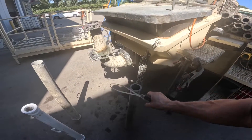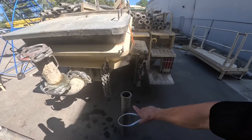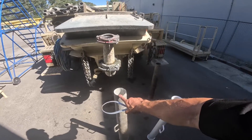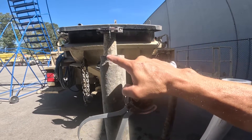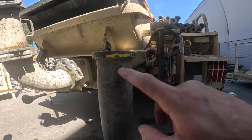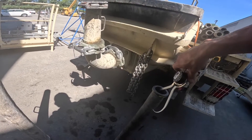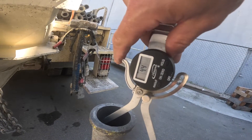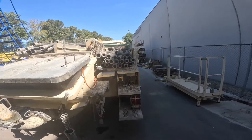I wouldn't wear this down much thinner than it is. Two and a half to three mils is kind of what I would say. Brand new, they're almost seven. So when we get down to about three — where this is — it's time. Don't measure down at the bottom; measure right where that flange is, from the weld to the flange right in here. Not down here, because it's still nice and thick everywhere else. If I drop in a little bit further, you're still at about 4.4 millimeters, and it's not because it's thicker there — it's just much less worn.